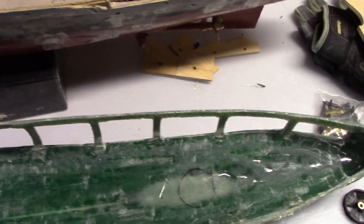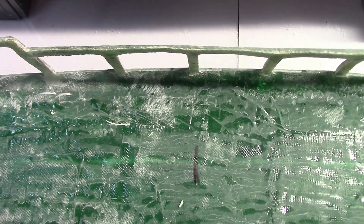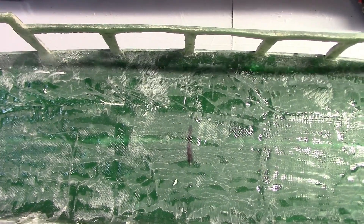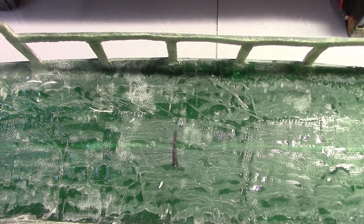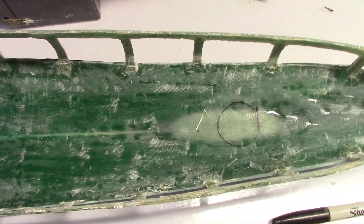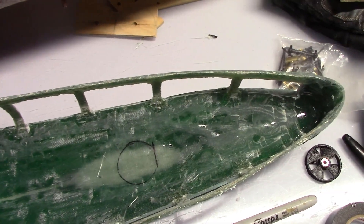To start, some prerequisites: I'll mark the center of flotation with a line, which I determined from my float test. This will be the point that I'll want to balance the boat — if the boat balances with its components within an inch or so of this point, it'll be pretty good when the boat is finished for the first float test. The other main thing is determining what gun layout I'm going to use, because you need to know where the guns are so you can deconflict appropriately.